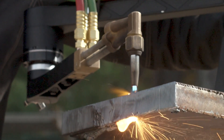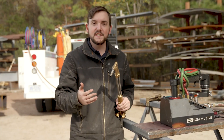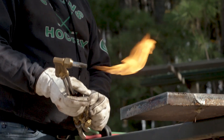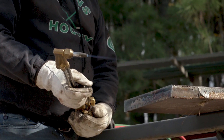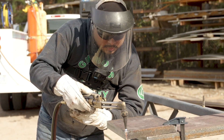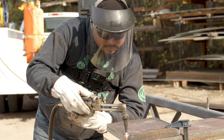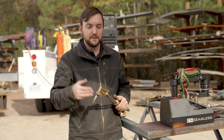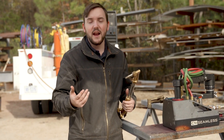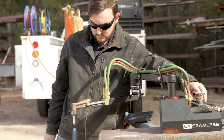Now that you've got the mechanical operation down, you want to be safe. I'm wearing a pretty thick jacket here. If actually cutting, you'd want nice welding gloves, heat-resistant pants, long sleeves, and of course cover your face. You also want at least number 5 rated safety glasses — a darker shade, not necessarily welding-rated, but high enough so you're not staring directly into the flame. Shade 5 glasses also make it a lot easier to set the preheat because you can see the flame much more clearly.